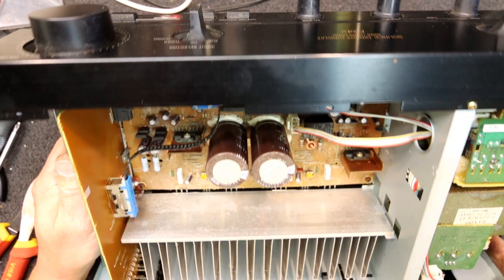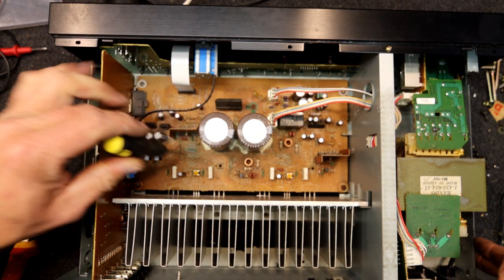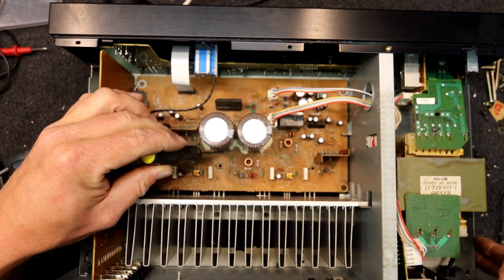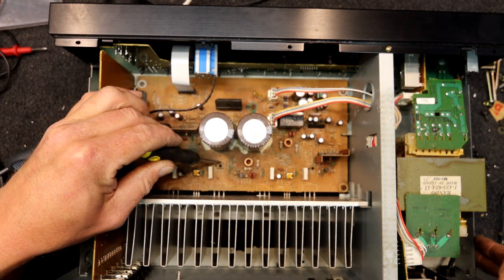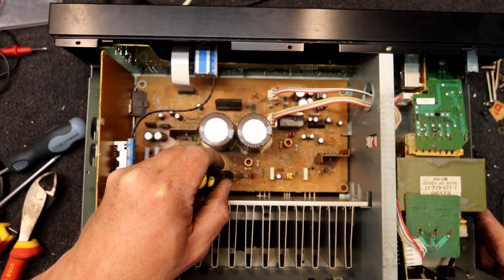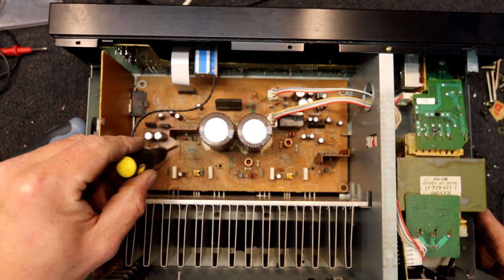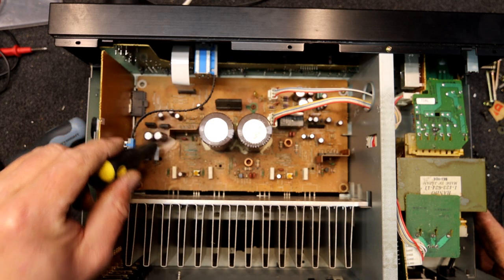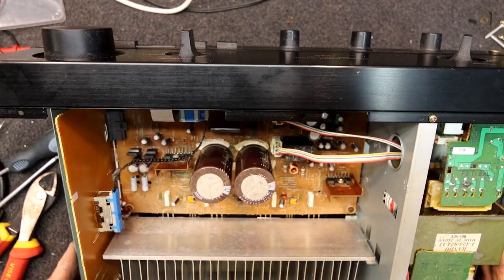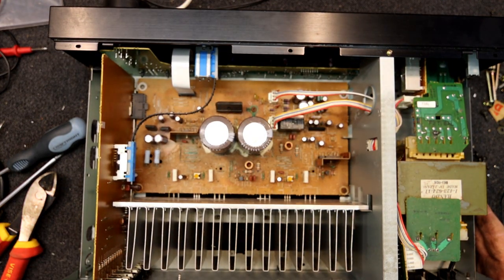I don't think there'd be anything conducting. I'll give these links a little flick to see if they're actually still intact — they do seem to be physically okay. Sometimes corrosion will eat through something like that, same with these resistors and little transistors. This part of the board isn't too bad; it's mainly this section along here. That chip has a lot of corrosion on the heatsink, this one has a little bit — it's been quite wet for quite a while.